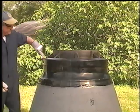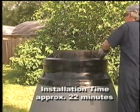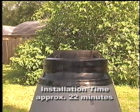Rapid Seal should be allowed to cool to ambient conditions prior to back filling. However, water quenching is acceptable to facilitate immediate back filling. Use selected back fill materials to minimize any damage to the sleeve backing.